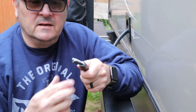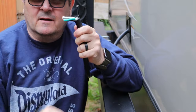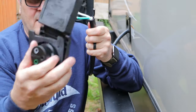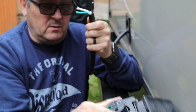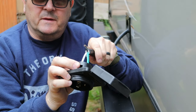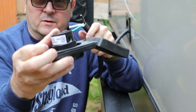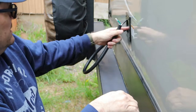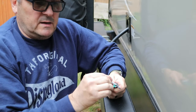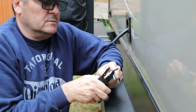Like I said, it's real simple — you have a green wire, a black wire, and a red wire. I'm going to strip these and they're going to go right in here. They tighten up with set screws on the sides, and then we'll be ready to put the box in. Let me get the wire strippers.